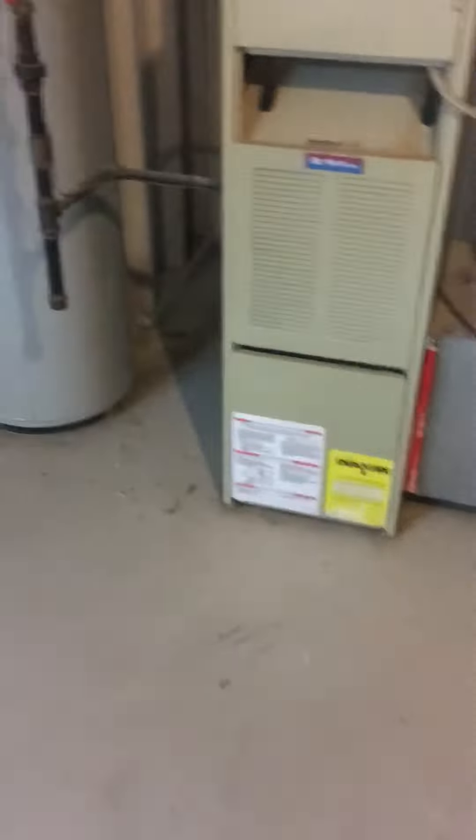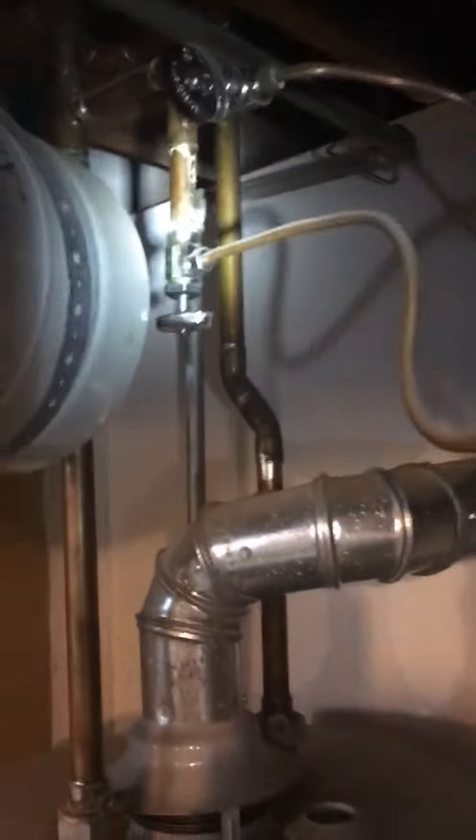Transition to flare out to catch a new 5-inch filter. He does currently already have a flue liner, so we don't need to worry about that. And we do have a good valve for the humidifier, so it's just making a connection over to the new humidifier.